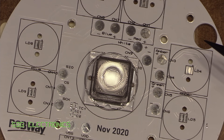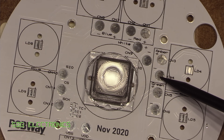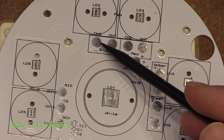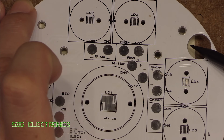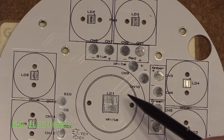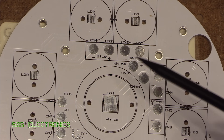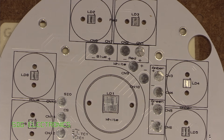In terms of connections onto the driver board, we've got pads here that might cause trouble when attaching wires — we're basically soldering onto a heatsink, as this aluminium is very thermally conductive. You can't have through-hole connections on the PCB because you'd short straight out onto the aluminium substrate, and I didn't find a suitable surface-mount connector that could handle the high current. We might need to keep the PCB on a hot plate at around 100 degrees so it's easier to dump the extra power into the pads and melt the solder.